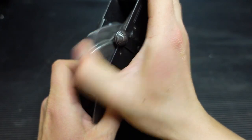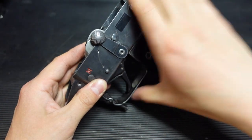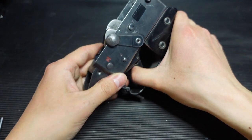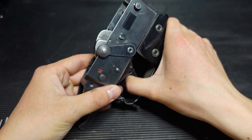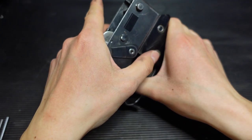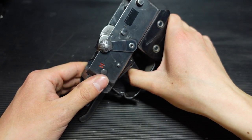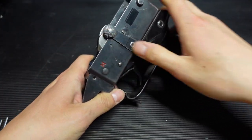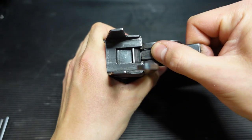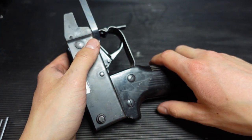So let's try, cock the hammer, spring feels good. Nice positive retention. Safety functions, place it on E, M, nice and crisp. You can try the first stage. Looks pretty good. Now you can see the very nice positive engagement of the sear with the hammer and then the release. Pretty good. Let's try the reset. Excellent. Check if the pins are retained. Yep, seems pretty good. Magazine catch and magazine catch lever seem fine. So I say we proceed with the disassembly and get to it.